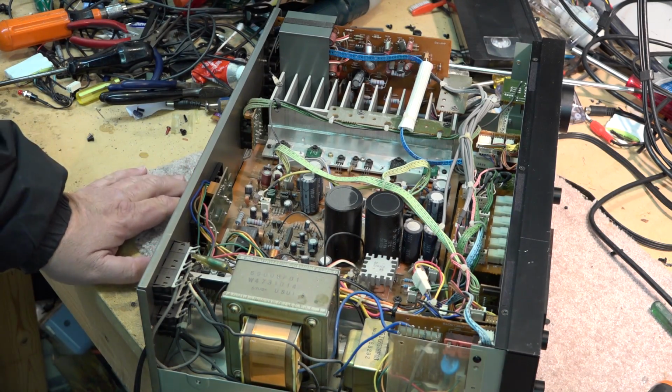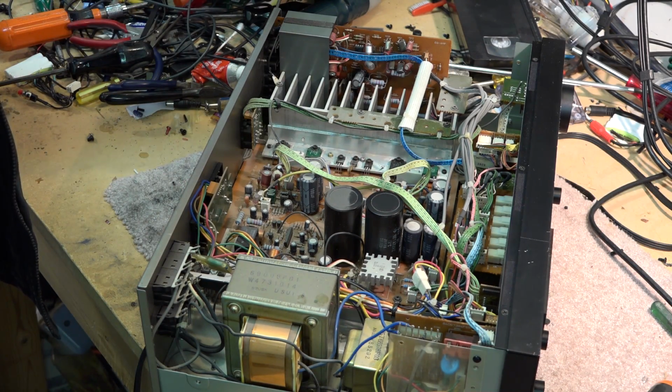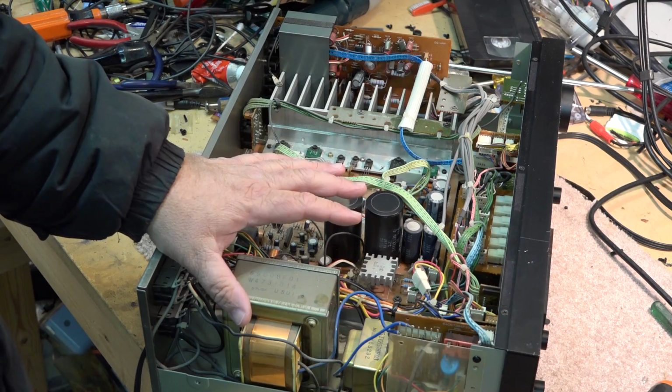Even order harmonics, though, are all in phase and they're all in step musically with your sound. So that's where you get your overtones, and that's what makes a guitar amplifier have that full, bold sound, especially in the distortion range, is the even order harmonics. And that's why today you still see tube amplifiers.